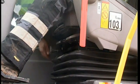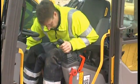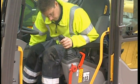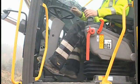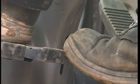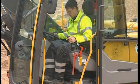Adjust the consoles, armrests and the backward and forward position. Try holding the joysticks and using the pedals and continue adjusting until you are satisfied. With your foot, press the button on the bottom of the steering column to adjust the position of the steering wheel. For best visibility when digging, move the steering column out of the working area.